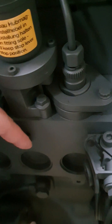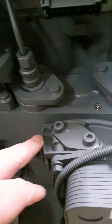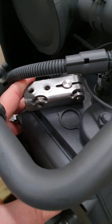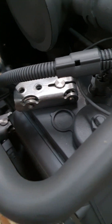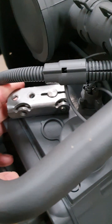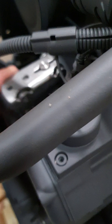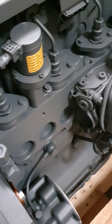You've got an arm that goes down inside which actually goes into your fuel rack, which connects all your pumps together and then obviously to your governor box. On your governor box here you've got a manual stop, and you can see there's no restriction on that stop at the moment. Once your solenoid is powered up, if it's working, this will turn part way and then you'll feel it touch the end of the rack — it's like a sprung pressure and you can actually feel it moving the rack inside the engine, because it could just be a stuck rack as well.